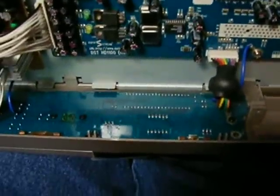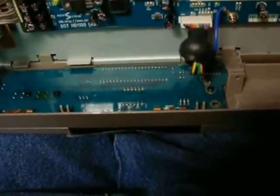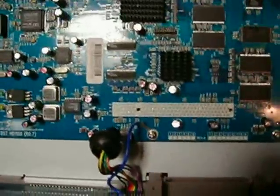The front panel is a simple LED readout — it's not LCD, just a plain LED readout. It's got an onboard clock and all that other stuff. And there's your working RAM, your static RAM. Your EEPROM is over here. I don't like these magic carpet ICs here — they're the long ones with leads only on two sides. They tend to not solder well. I may try resoldering that.